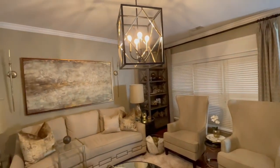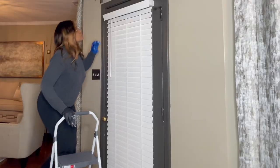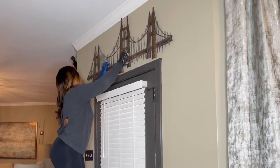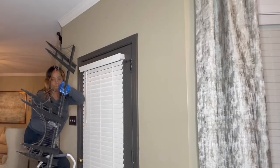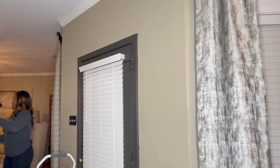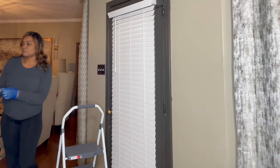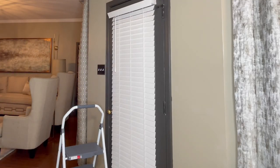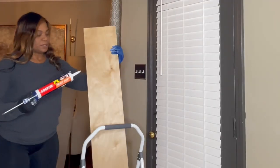We're going to show you the light fixture that I picked out towards the end, so please stay tuned. I did get my boards already cut to size at Home Depot — I just went in with my measurements and let them cut the boards, and I cut all my trim when I got home. First up when you get home: number one, prime your board. You can use primer or you can use the paint that has primer in it. I chose to use primer.